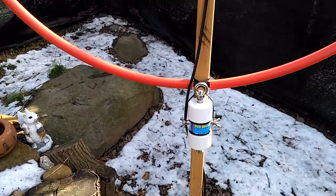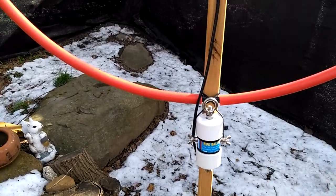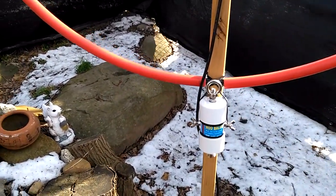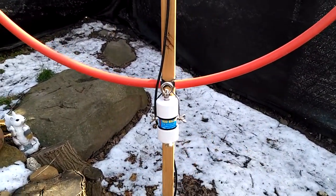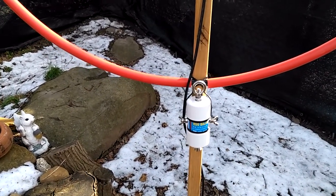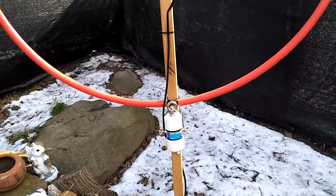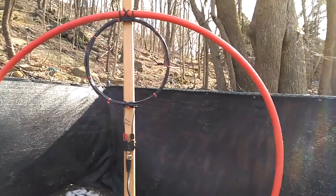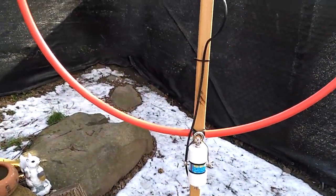People told me I should not have used the balun, but some actually told me it works as a choke — which it does. I tried it both ways. Disconnecting it didn't make much difference, except that with the balun in place it was a little cleaner and quieter. So it acts as a choke. And as you've seen in several videos already, it's working pretty well on shortwave — I'm surprised.